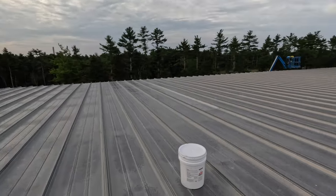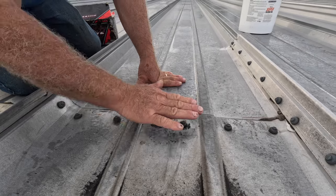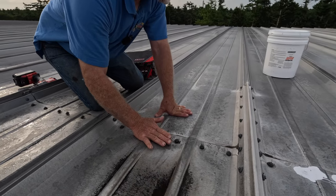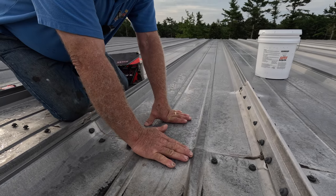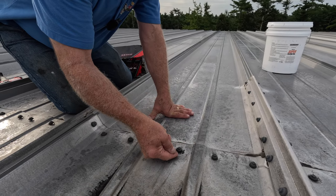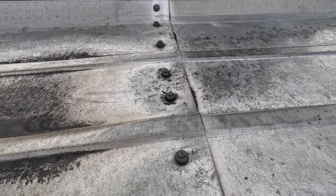If you look at this roof, there's a gasket between these two metal plates. These screws, when installed, were fresh and the gasket on the screws was still fresh. So the moment they tightened it to a certain torque, that was okay at the time. But this gasket has dried a little bit, and therefore the screws are loose now — and that's what causes the leaks.